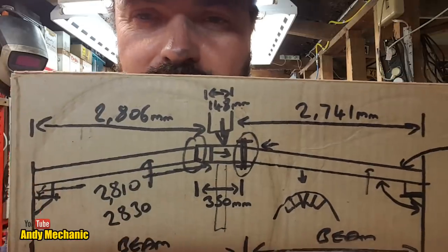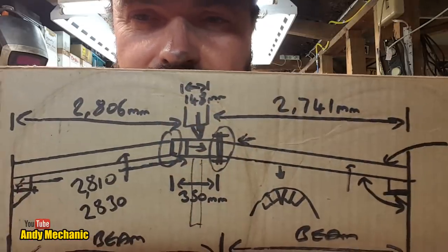That's going to be another video. What do you think? Do you think that new design — with this almost arch shape, a very shallow apex of maybe 5 or 10 degrees — is that going to reduce the amount of deflection with that load? We'll do the same thing, go up to 250 kilograms on the coffee table, and see what the reading is. If it's the same, we've lost nothing. If it's less, that's a bonus — that means the structure can carry more weight, which gives us a bit more margin for error.